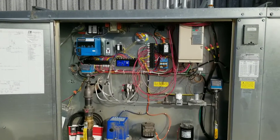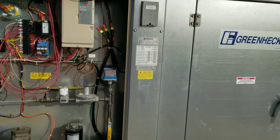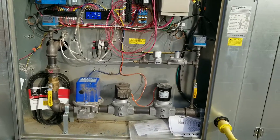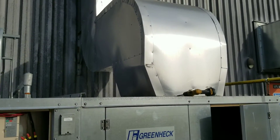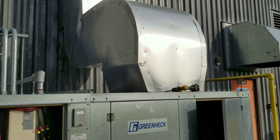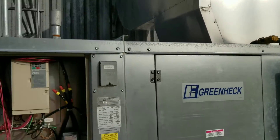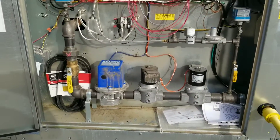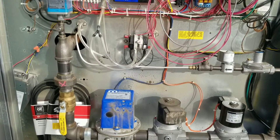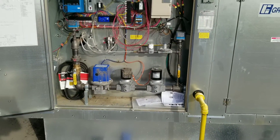I'm back, just to give you an update. I spoke with Greenheck Tech Support — they were on the ball answering the phone, didn't wait two hours like typical. Basically, everything I thought was happening is happening. The supply duct has a lot of turbulence right out of the unit. It's supposed to have double the duct diameter length coming out so you don't create that turbulence in the air. My gas pressure adjustments were good — they don't go by gas pressure, they go by temperature rise. My temperature rise was good after I adjusted everything, and they go by the look of the burner. We got a nice blue flame, so everything looks good.